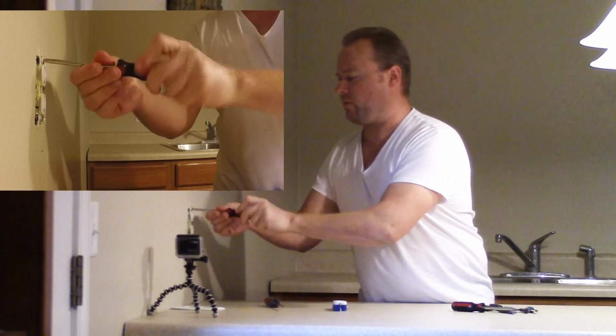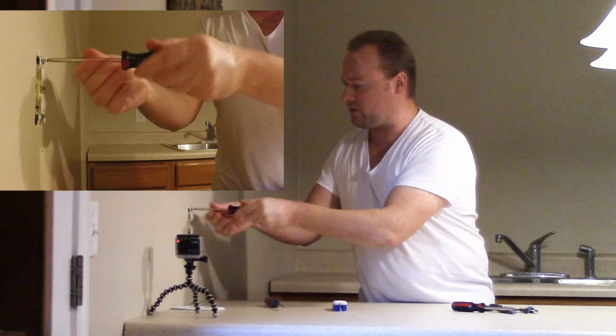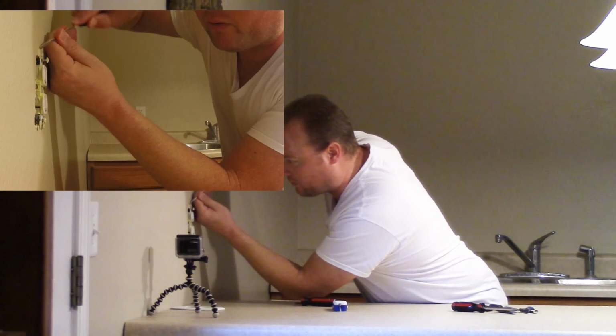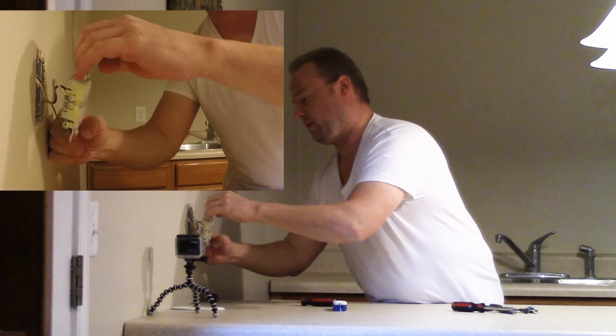We're going to take this off. We're going to be careful about taking it off because it's got paint over the tops of the brackets here, not the actual outlet, and we don't want to tear the sheetrock. So let's stick this screwdriver behind it and make sure that the paint doesn't tear up the wall. There we go. Okay, now we have a loose outlet.